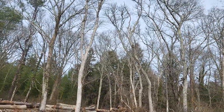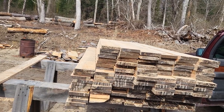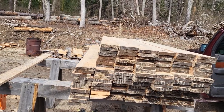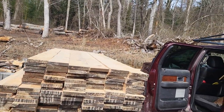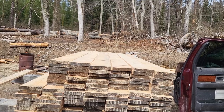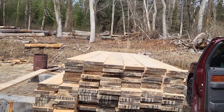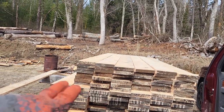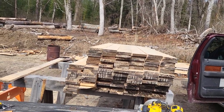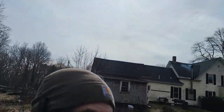I don't know. If you look down the edges of those top ones, down the edges this way, it's milling nice and flat. All the waves that I see now came off the previous band. I don't know if you can see the waves in those two. They're not big waves, they're teeny waves, but overall, as you look across the stack, for 20 high, it's pretty uniform height-wise. So even eyeballing the numbers, it's cutting pretty good. So I don't know. That's where we're at.